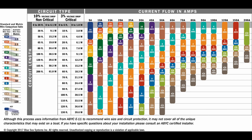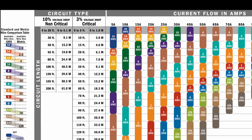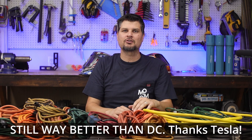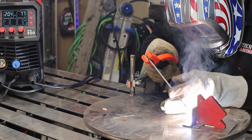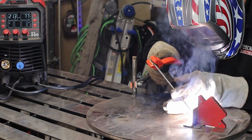There are many charts online, and one thing you'll notice is something called voltage drop. Over a long distance, you actually lose part of the voltage due to resistance in the cord itself. You have to account for that, especially when running tools or welders that really need all the voltage possible.